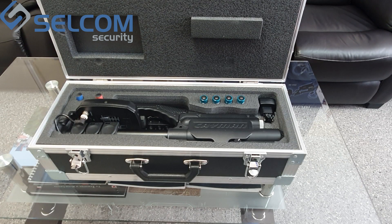The principles of operation of the Cayman nonlinear junction detector (NLJD): instruments of this type employ active detection — they emit probing signals and analyze the return. Their primary search targets are electronic devices, which typically consist of circuit boards with conductive elements and semiconductor parts such as diodes, transistors, and microchips. The probing electromagnetic radiation induces variable electromotive forces, and the nonlinear current-voltage characteristics of electronic components transform the initial signal into higher frequency harmonics, which return to the NLJD's receiver.